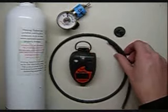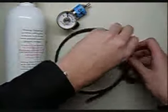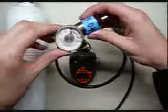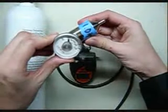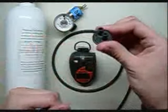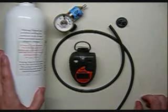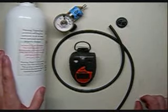You're going to need the monitor, a length of tubing. I always use the Viton tubing because it has the least resistance. A 1.0 liter per minute regulator, and the unfortunately named calibration nipple. Also, you'll need a cylinder of trusty calibration gas. We always use the Ideal Gases brand here.